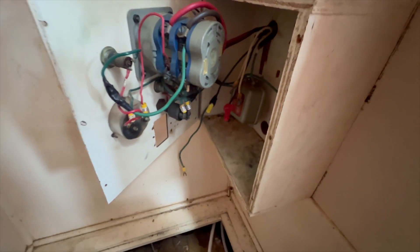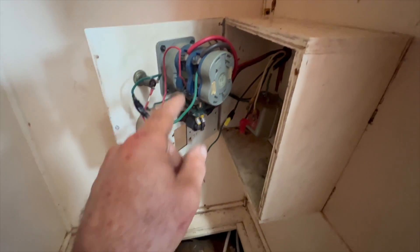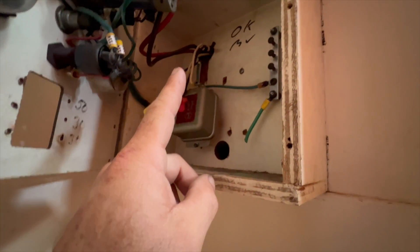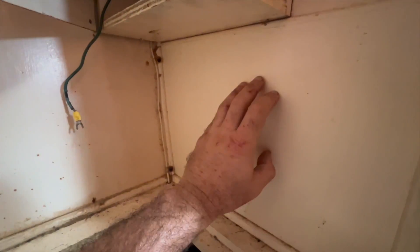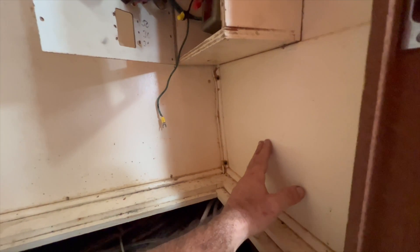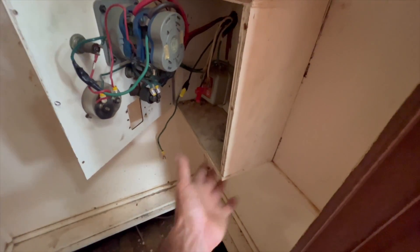I may just jump from here to here, which will connect the two bus bars, and then my black wire will go to my ground bus which is right in here attached to all that grounding stuff - not exactly the way I want to do it but we're getting closer. I've verified that this is my ground, that's my positive, my switch is over there which is where the big wire is going to go. I've got my two cables coming up now. I was going to build a cabinet right here but I think I'm going to cut a hole here so I can fish all the old wires out and tie up new ones behind the wall. I'm going to drill a pilot hole right now just to test the depth and go from there.